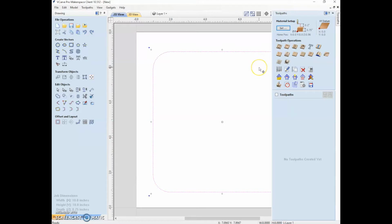And as another note, all of these different workflows, be it Fusion 360 or VCarve, or Easel for that matter, their goal is coming up with G-code to feed to the machine. And sometimes the program can't do the best job of figuring out exactly what it is that you want. So the best way to do it is sometimes to modify or to write the G-code yourself. So there are options in here where you can go into the actual code and modify it. But that obviously requires some familiarity with G-code, which is a relatively simple language that you can learn to understand the basic commands of, but you still want to develop that.